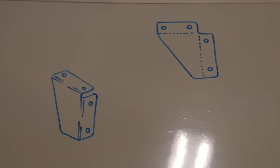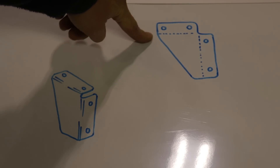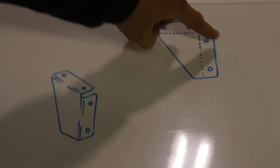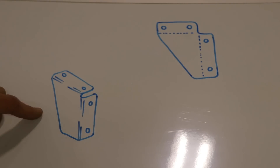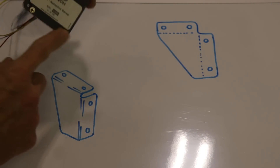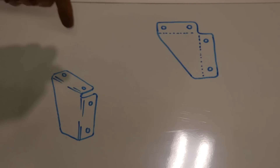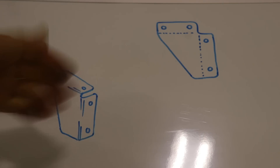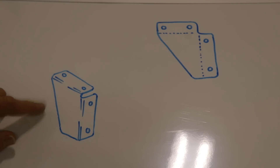Back to the whiteboard — here's what I'm thinking for a mount. If I took a sheet of aluminum and cut this shape out — the manual for the servo says to make it a minimum of 50 thousandths thick — I'd take it to my brake and bend it 90 degrees on each dotted line, and we'd end up with a bracket that looks like this. The servo would just fit in like that, with mounting holes on each corner and a little lip to mount it. This tab would bolt to the bulkhead and hold the servo right up next to it. There's one bracket on each side of the servo.